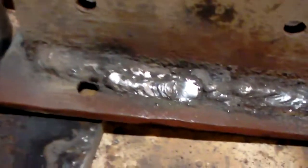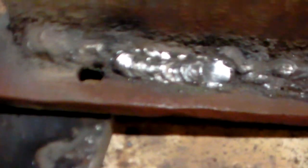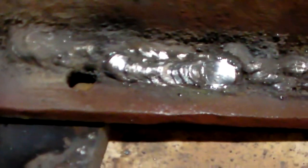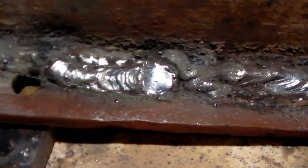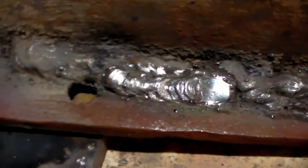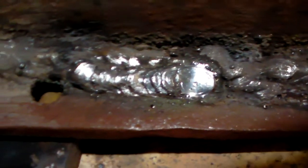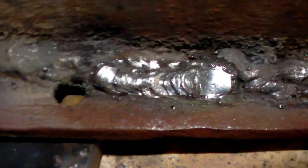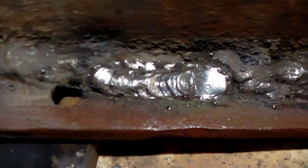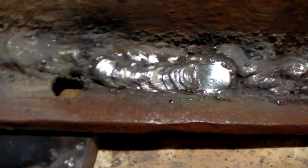There's our bead right there. At the beginning where I started, it looks a little cold — I don't have a hot start function on this machine, so that's a pretty normal occurrence. But as we got into the bead, it started getting hot, and I could tell it was starting to dig into the metal pretty good. This machine is kind of volt heavy, so even though I was really trying to keep my arc length short, it just started digging. But anyway, there's a bead for you — it's not too bad. Don't expect to have amazingly pretty beads on AC; usually it doesn't happen, and that's just an unfortunate nature of the beast. Let's run some 7014 as well and go over the settings and technique on that.